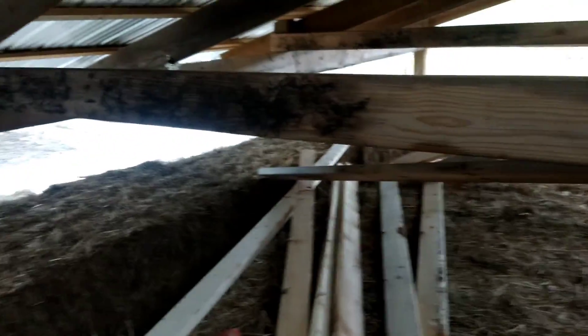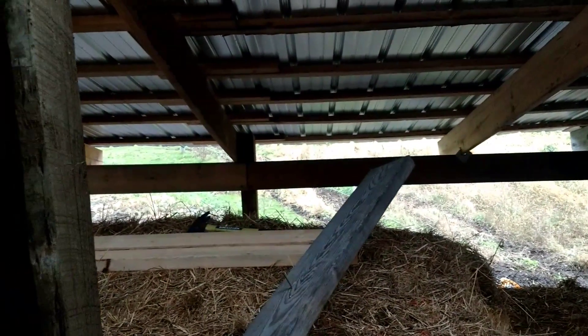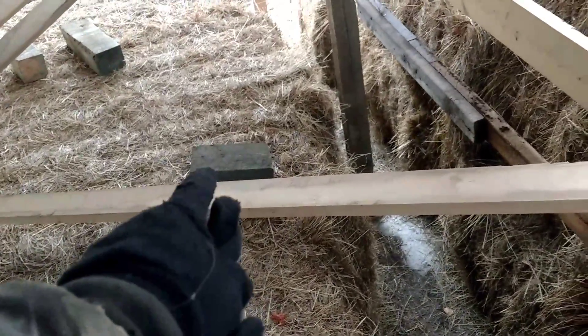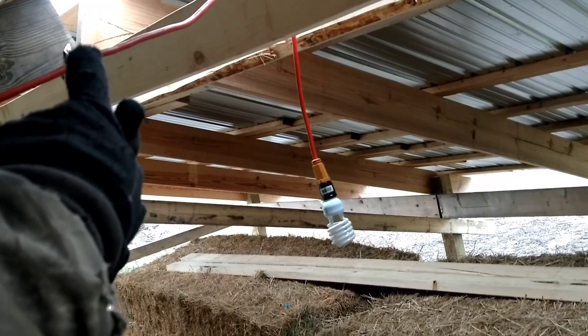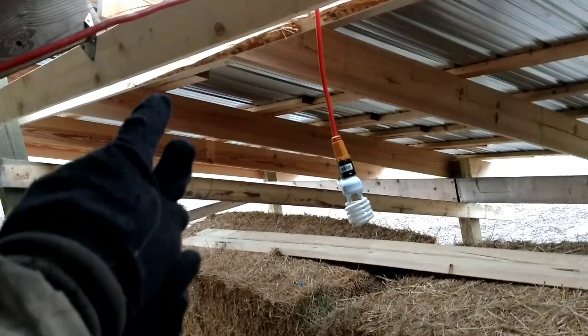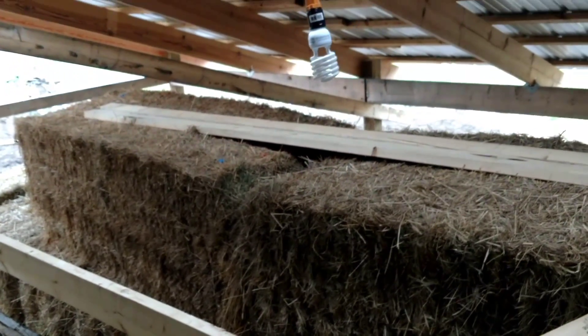When I go up to do that I'll put the rest of the screws in on the north side. Then all I have left is the 2x6 header boards on the outside, and I need to go back through and put more ring shank nails in the header boards on the inside. I'm going to put these stubs in between the 2x6s up here and screw the 2x6s from each side so it pulls together and they can't pull apart.